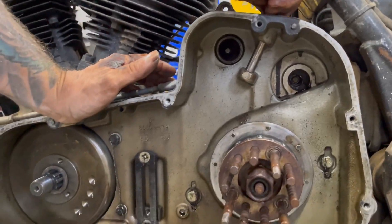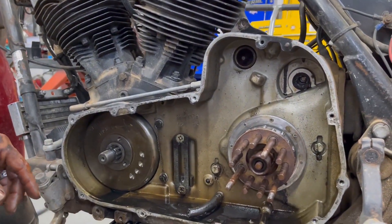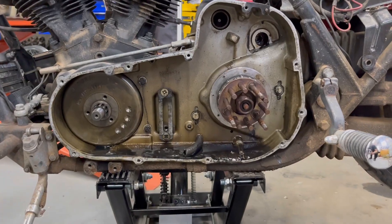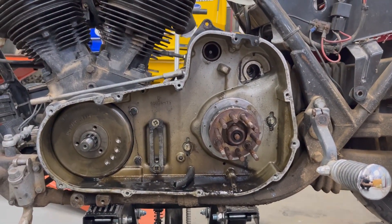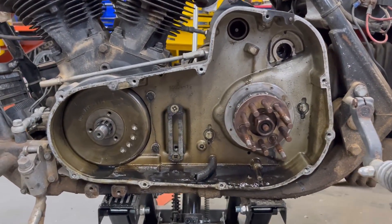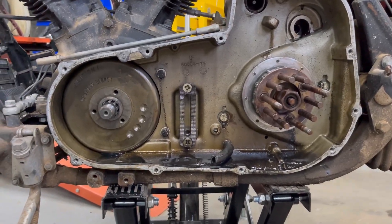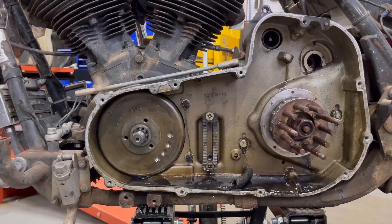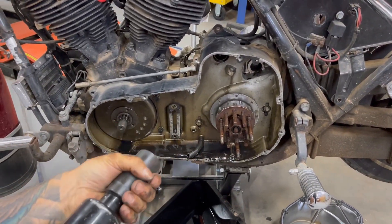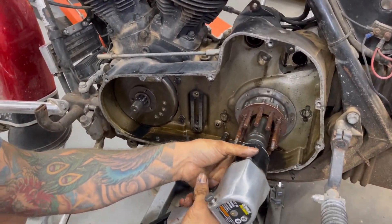It's going to fight me. Most of you guys that know, know that your transmission hub nut — this center nut — is left-hand thread. So the old righty-tighty lefty-loosey doesn't work there; you have to turn it to the right to loosen it. Is it an inch and a quarter? An inch and an eighth? That's the one. We've got to put this on tight — and righty-tighty is actually loose on these.